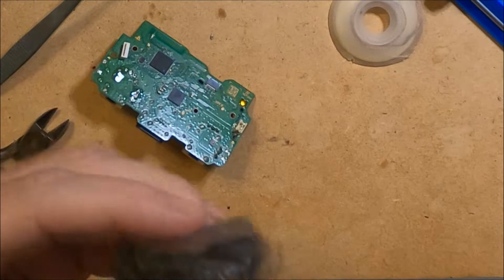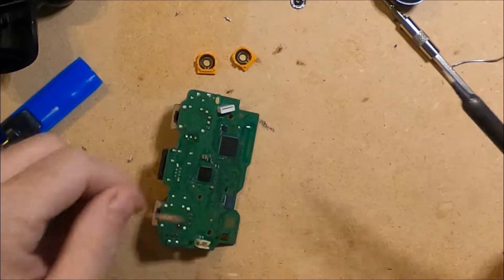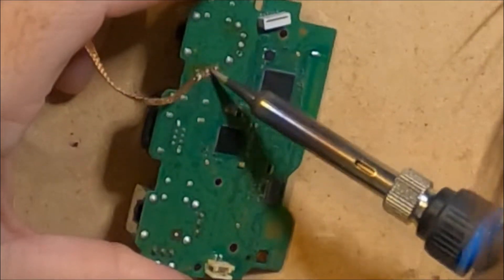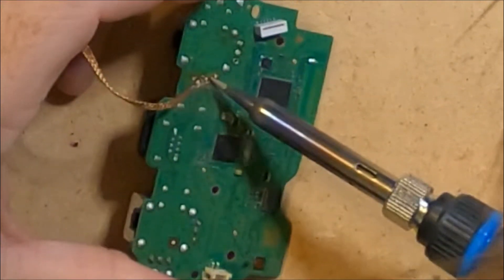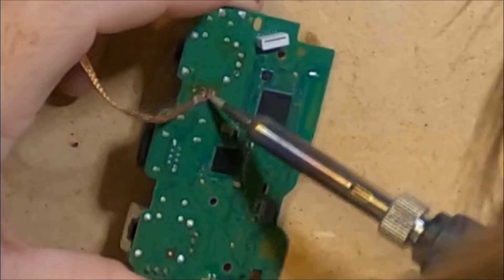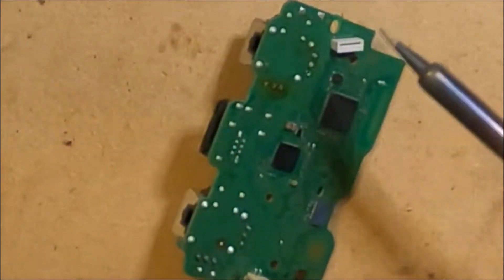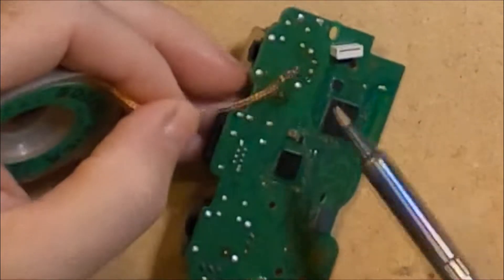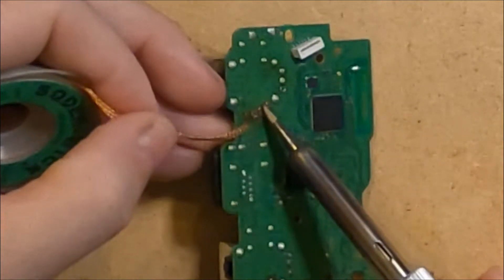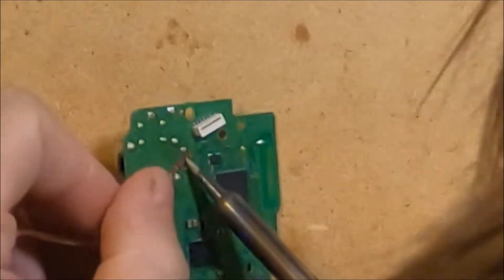I clean the soldering iron with a little steel wool. With all of the pins removed, I will use some braided solder wick and clean up the surface. I have tons of room to work with here and can move the wick back and forth. I don't apply any force as I do not want to damage the board. This particular pin is the ground pin and it is giving me a little trouble, so I'll add a little bit more solder — and that seems to do the trick. I continue with the solder wick until all of the vias are clean.